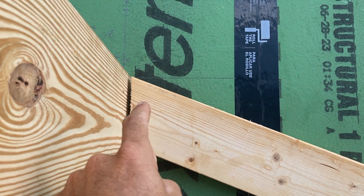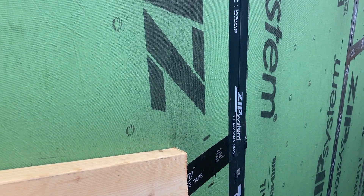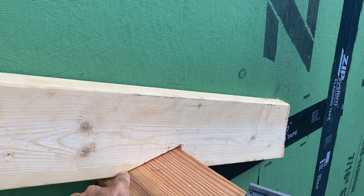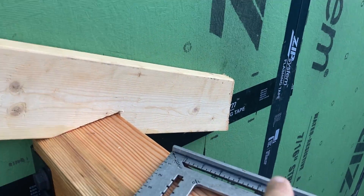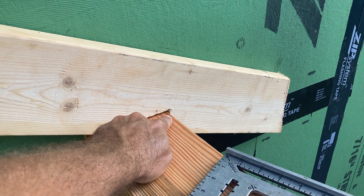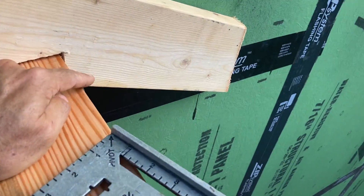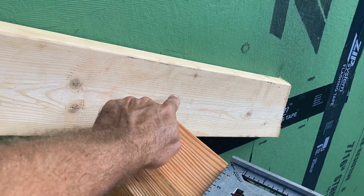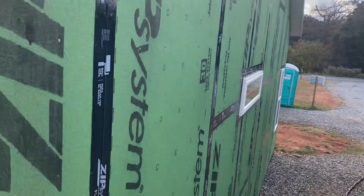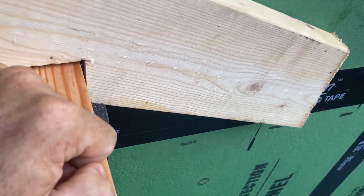Here's my first rafter. Knowing that my pitch was about four and three quarters, I could make the plunge cut angle and the fascia cut angle as well. The only thing left was to figure out how deep I wanted my plunge cut to go, and then from that point you come straight back for the seat cut. I started with an inch and a half deep plunge cut, but that forced my overhang to be 16 inches long before I could get underneath those bolts on the backside of that bracket. So I increased it by a half inch to a two inch deep cut. That allowed me to pull my overhang back to 12 inches, which will match the rest of the overhangs on both buildings and will allow my soffit panel to run underneath that bottom bolt.